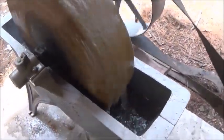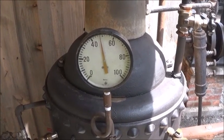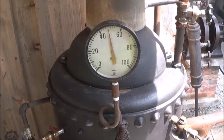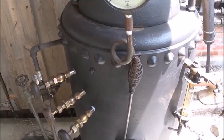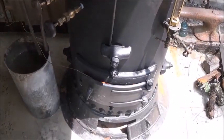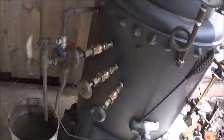I'm going to get that piston in the boiler and get it heated up. Alright folks, I just put water in the boiler — I think it was up to 60 pounds, and when I put the water in it cooled it off a little bit, but we're just gaining pressure from that. Even with it running, this is half the size of what this boiler was made to run — actually a little less than half. It's a horse and a half instead of a four. So anyway, I've got our piston in there, we're going to pull it out, put it down, and then try to push the rod through it. If you get it hot enough it should go pretty easy.